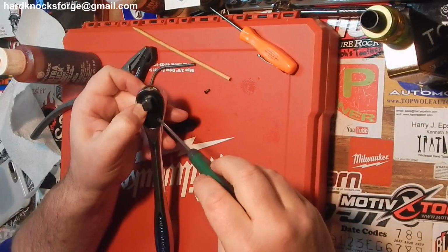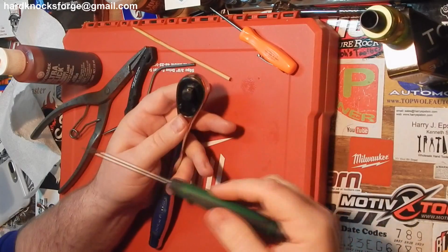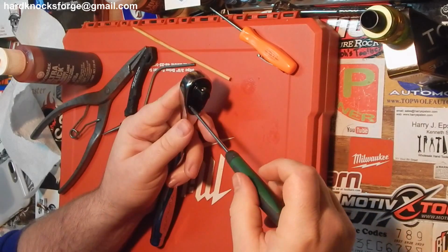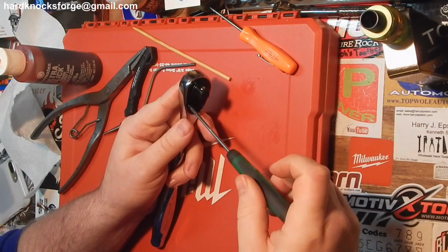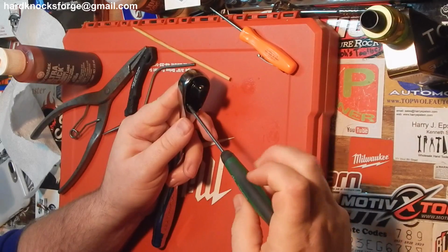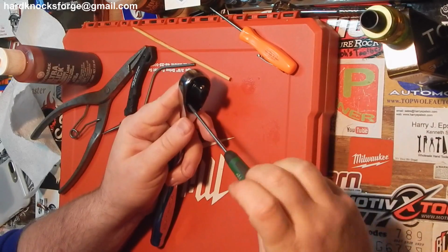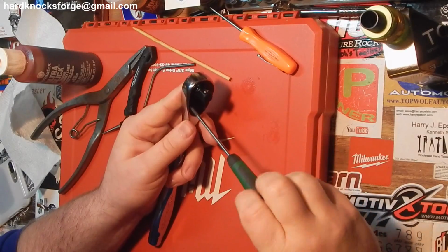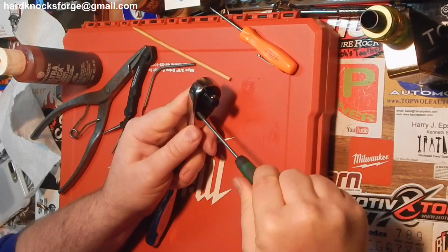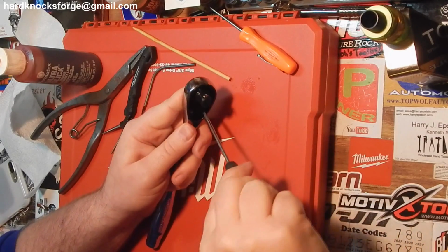I don't know, a little trick I do on these little guys so that I don't cross thread them is I actually back them up until it clicks into place and falls in that first groove. Then you start it. You won't ever cross thread a screw that way, especially these little machine screws, which are super easy to cross thread.